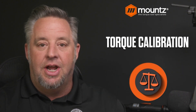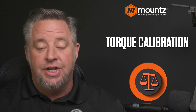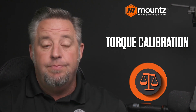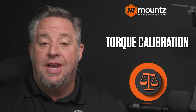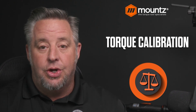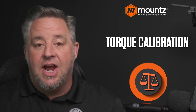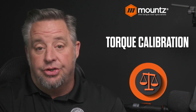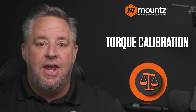When we talk about torque verification, there is a distinction between torque verification and the torque calibration process. Typically, torque calibration is done by testing the torque tool against a standard or a sensor, and the requirement is that the sensor must have at least four times the accuracy of the tool being tested. That could be either an ISO type specification or an ANSI Z540 specification. Calibration is typically done in a laboratory under certain conditions, and a certificate is generated — that's a bit different than the verification process.